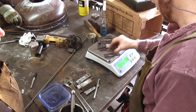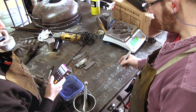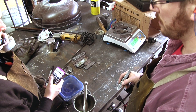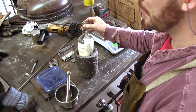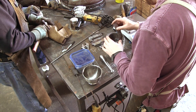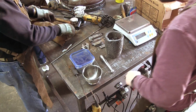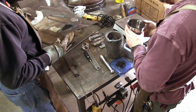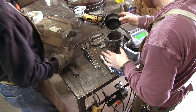We are preparing two clay graphite crucibles that will be charged with wrought iron, charcoal powder, O1 tool steel, and glass. We use only the highest quality ingredients. We are aiming for 1.4% carbon for the first ingot and 1.6% carbon for the second ingot. We do not know how much carbon will be absorbed from the crucibles themselves.